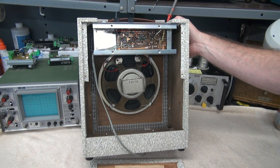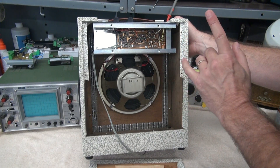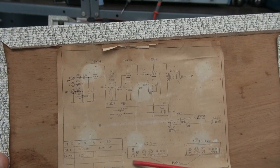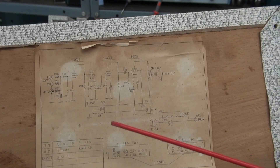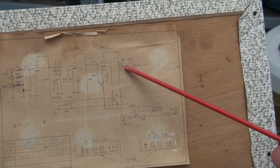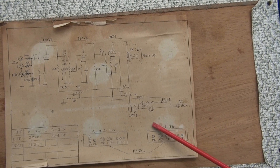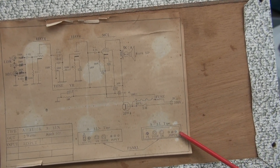So this thing's definitely worth restoring or repairing. However, you do not want to do it in its current configuration without a power transformer, because it is still a shock hazard. Conveniently, back in the day, they would put the nifty little schematic right inside the amp. You don't see that anymore. Here is the tube lineup — you've got a 5K transformer, 8-inch speaker, rectifier. Here's the chassis layout. If you look right in this area, you'll see there's something missing — it's called a power transformer.